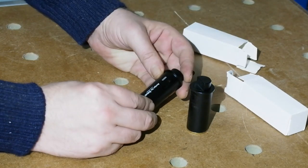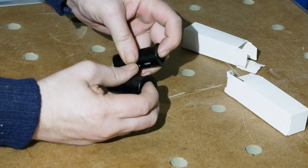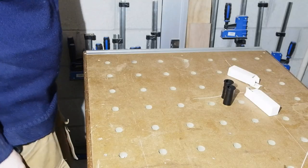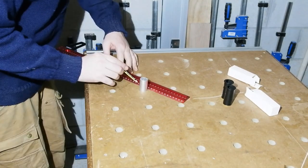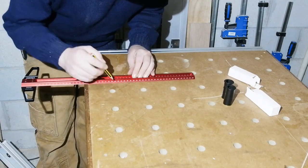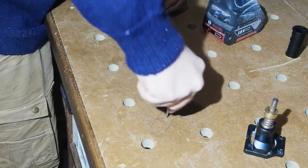The last item in this part one video is these push-button retractable bench dogs, again by Ganway. These are sold as a pair for around 15 pounds currently, or a set of four for just over 22 pounds - a significant saving on the set of four. Even the pair price seems a bargain given the build quality. It's all-metal construction, the dog stops rotate freely and push in and out. These would be most suitable for traditional carpentry benches with a front or tail vice, but absent one of those they'll be fitted to my MFT-type bench. I settled on the front left, central between an existing square of dog holes, and I'll use them as quick clamping stops.